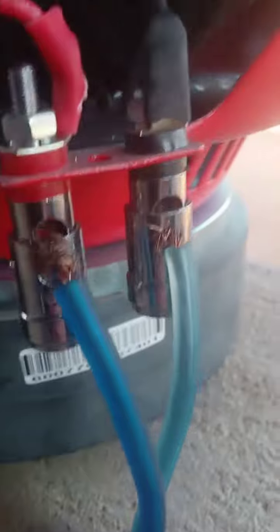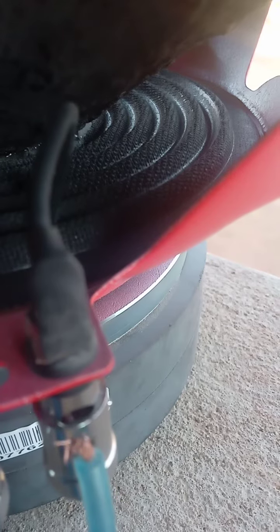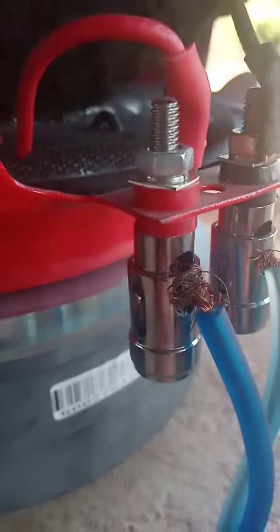The spiders also look a little bit different in design. On the Star Sound, where the first corrugation starts it's a little bit lower, whereas the Taga spiders are a little bit higher — there's a higher hump where the first corrugation starts. The terminals look exactly the same.